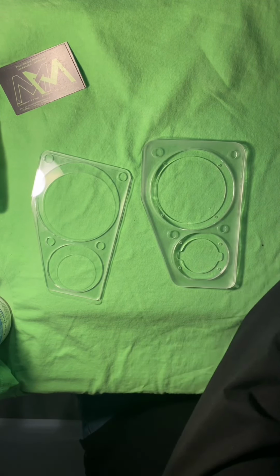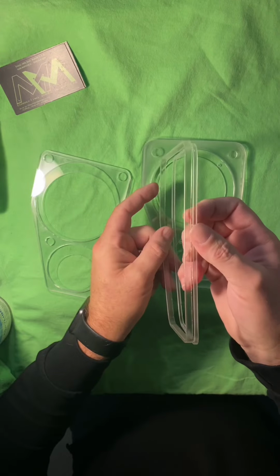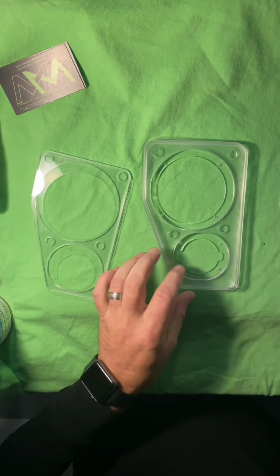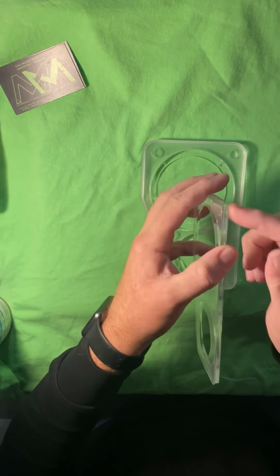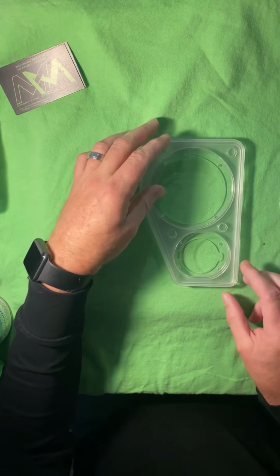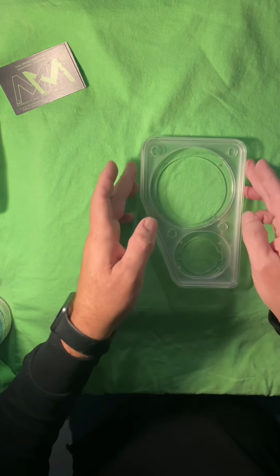And then of course, after that's done, I always do this part last, not sure why. But then we have our two, a piece of 6mm and a piece of 3mm that are our rings that basically will just encase the grill and everything when it's done. So we have one piece that'll go down there like that. And that's approximately the same thickness of this, less the 0.75 on each side. So it's 1.5 bigger. But if we sit this in there, we can see that it protrudes just a little bit. So we add this piece of 6mm on top, just like that.